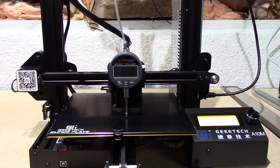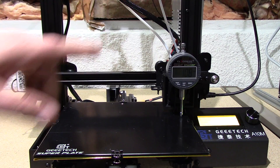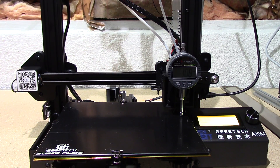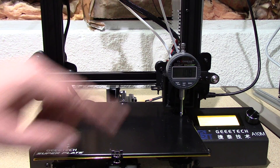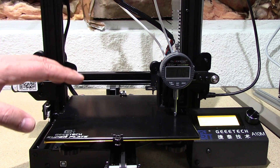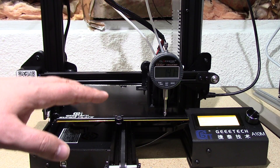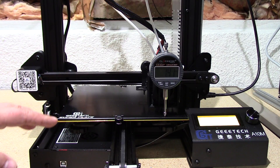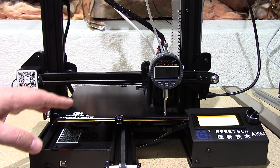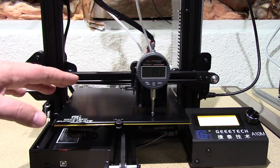Then it will run across the bed, and you can see I'm a bit off on the bed here from this corner. What you want to do — and I've done videos on this in the past — when you tram this, you want even distribution across the bed. You'll never get it totally perfect, but the idea is to get it as close as you can.